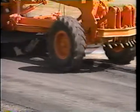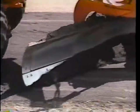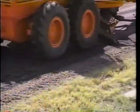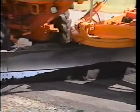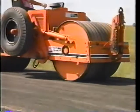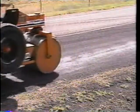By using a sharply angled blade on the finish pass with some down pressure, any loose material will be removed. During the finish lift, no more adjustments than necessary are made. The number of passes is determined by the width of the patch area. The material should run out just before reaching the end of the patch, and there will be no pile left. A very small amount of material should roll off the edge along with the chunks — this will assure that all drag marks can be filled and the surface will be even clear across the patch. If material does not come out all the way, it will leave lines running in and out, which are called scallops. Rolling down the chunks along the edge leaves a good appearance to the patch.